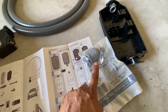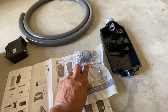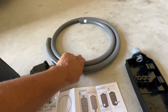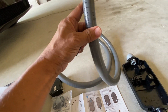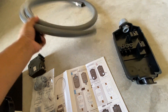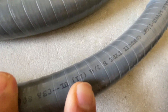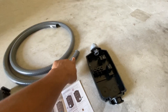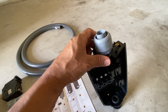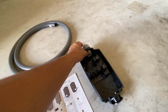You'll also need a fitting for your breaker box where the main wire is going. I picked up some flex conduit — it runs about a dollar a foot — and it's the same three-quarter inch size. It fits right into the fitting; you loosen the fitting, slip the flex pipe in, and tighten it down to hold the flex pipe in place.